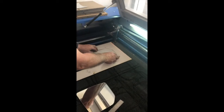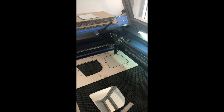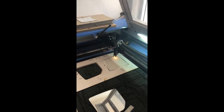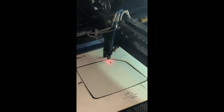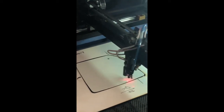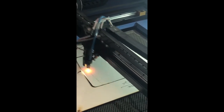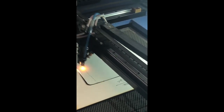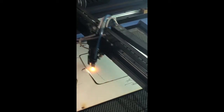Once the linishing or edging is complete, we then place the finished mirror product in our laser machine to have any images or text placed on the rear side in reverse, as per the customer's instructions. This can include proximity warning apertures, heating elements, and other text that's required for convex mirrors on many occasions.